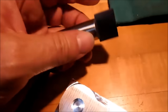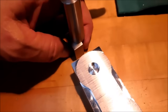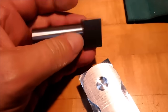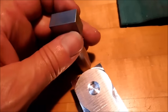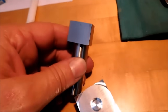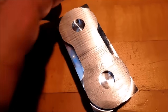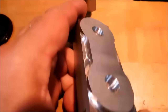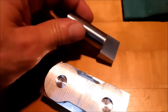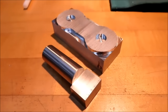But I think you see the advantages of having one of these. You can use this flat face here as a registration face for your part. You can squeeze it in the vise and move the entire vise before you clamp it down. And if you wanted to somehow incorporate the 500 that's given on the part — because it's 500 this way and 500 each way from center left and right — if you want to use gauge blocks or whatever, you do have the option. The flat face will probably see most of the use and you can see the benefit. That was lightning quick and if you had to do that any other way it would probably be a real pain in the neck. So I hope that helps. If you guys that have bought these already have any other questions, feel free to post them in the comment line, and if you have already used it I would love to hear how it worked for you as well. Thanks for watching.